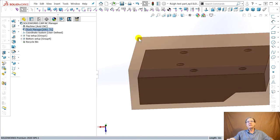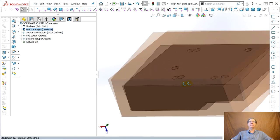You're trying to make this point right here 0, 0, 0. And when you get the tool there, one by hook or crook, if you find an edge with an edge finder, you've got to do a little subtraction. But in theory, you want 0, 0, 0 G code. You want to reset everything to zero when the tool would be right there. That's the nice thing about the tool probe. It's like an inch up and a half inch over, and it puts all that in automatically. It's got a little script inside the Mach 4 controller. So that is that. Here we go.